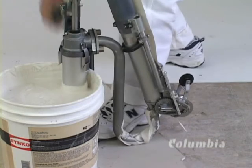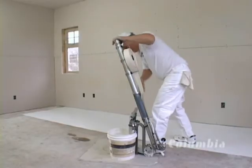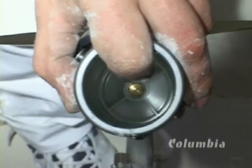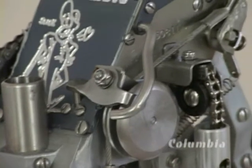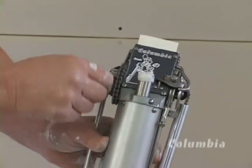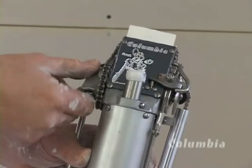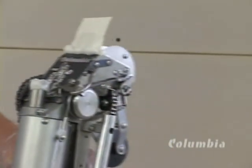Place your foot on the foot pad of the pump and begin pumping. Place your free hand at the taper opening to check the fill progress. It'll take eight to nine pumps of the handle to fill the taper. Once full, lift the mud gate lever to the open position. Prime the taper by winding the main drive until mud is seen on the tape. The taper is now ready for taping.